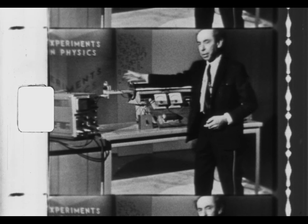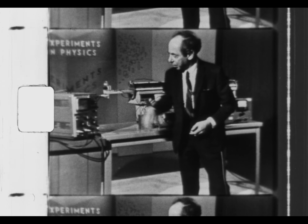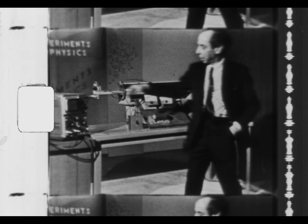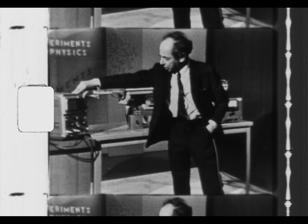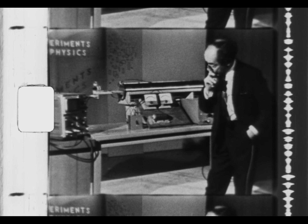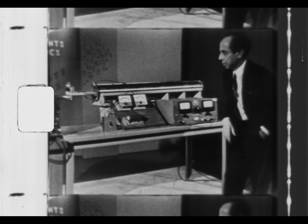By going to the very high speed, I can again get a straight line across. And from those two, I can get both the voltage and the time for any conditions of the coil. So I can vary the voltage, vary the number of layers, vary the loop, and see how this EMF — both in magnitude and in decay time — varies under these conditions. I understand quite thoroughly what's happening inside the solenoid. When I'm not actually making a measurement, I want to be sure to keep these on a non-store setting, since the life of these tubes is at best limited and goes down rapidly in the store position. That's all one needs to know to make the measurements on this experiment.